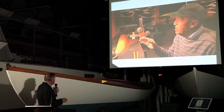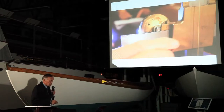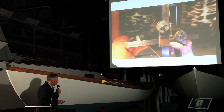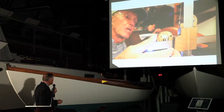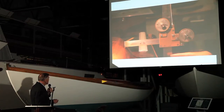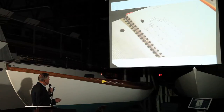Here's Adam Langman also using it — he knows how to do it as well as I do. You see how easy it is to read. These numbers are read in feet, inches, and eighths. What we do today is we put the numbers into the computer, which converts them to decimal feet, and then we draw a picture from that. If there's any dent in the picture, we come back and re-measure it and correct the dent very quickly. You can see how easy it is just to go to a set height, then come down, intersect the hull, and measure the offset. I went in one direction against the stop so that we're dealing with even units of model inches.